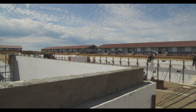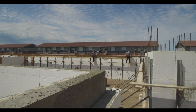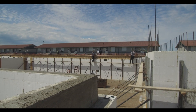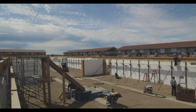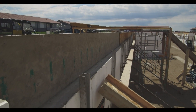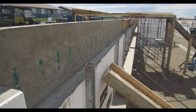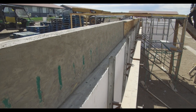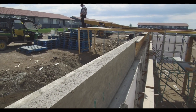I'm on a job site where they used the FoxBlocks curb block and I just wanted to show it to you to see it in action. They just finished placing concrete two days ago and now they're stripping all the wood off of it. Here you can see they cut the block down eight inches and cut a taper into the block, giving them five inches of concrete to play with — actually up to six. At the top they have four inches of concrete and on the bottom they have a sill so they can rest the floor on. Coming around the corner, they actually have a 20-inch high curb — four-inch wall going 20 inches high and below that is eight inch with a taper. They used a two-by-six, some OSB, a two-by-four on the top, and some straps across that, placed concrete, and ended up with a really nice straight curb.